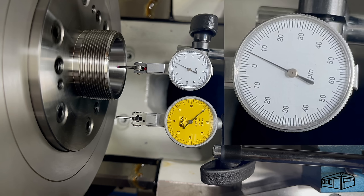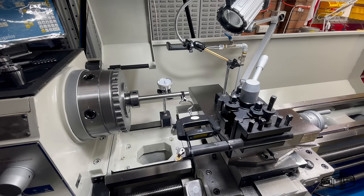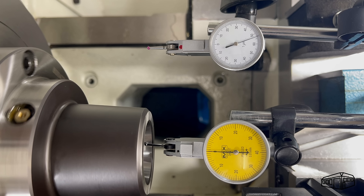To put things into perspective: although I do have air conditioning in the shed, I don't have climate control. This is not a Class 3 clean room — it is a shed, and it is subject to dust, temperature and humidity changes. For example, it was 38 degrees outside for some of the project, then the temperature dropped to under 30. What shows as 1 micron today likely won't tomorrow. Chasing zeros was fine once, but it is not something I will repeat any time soon. I have heard from people who reset their chuck runout every 3 months, and while that might work for some, I don't think I will be doing that. One viewer even commented that even breathing on it can change the observation. These are observations that I got in my shed, on my equipment, with my indicators and local conditions — you would likely see different results in your shed and on your equipment.